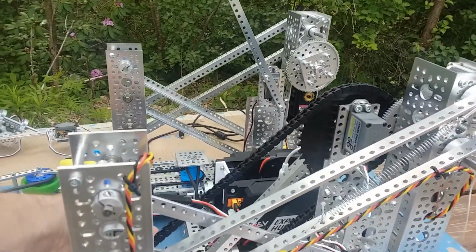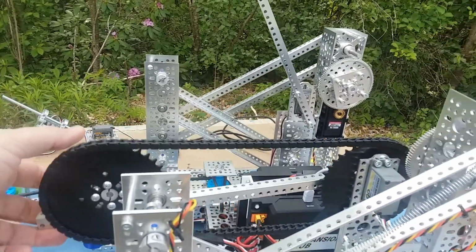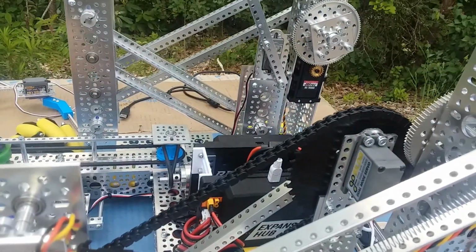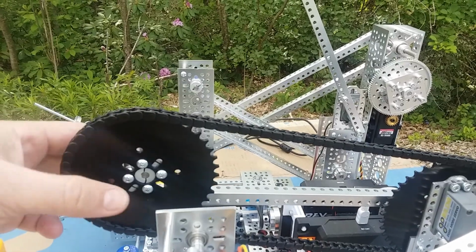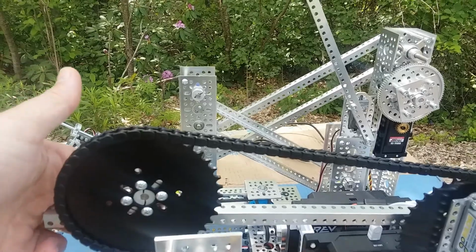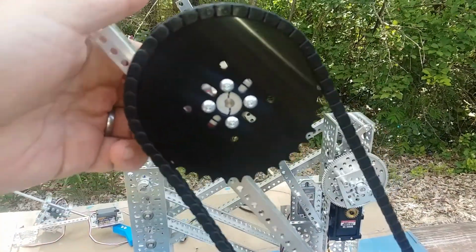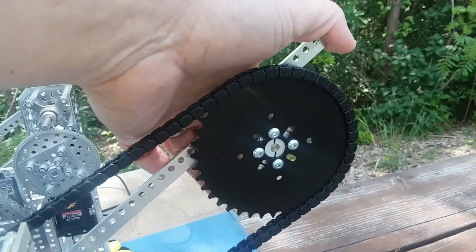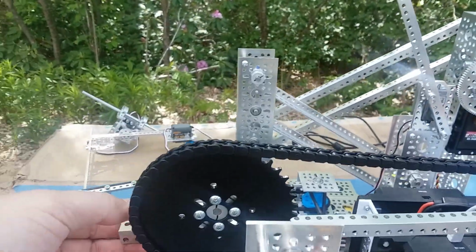We also put together the chain bar link, which you can see this sprocket over here is stationary. And what that allows the chain bar link to do is to spin. Now watch these two nuts at 12 o'clock and 6 o'clock. As I spin the chain bar link, you'll see they stay plumb. That means if you attach your gripper to that mechanism, it's going to stay plumb as well as you spin over and deliver the stone.